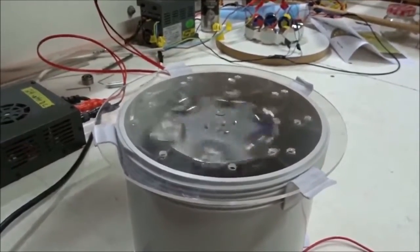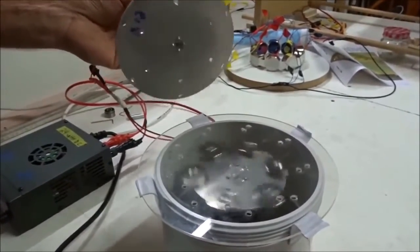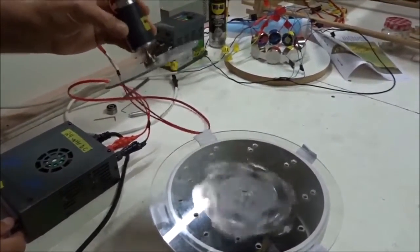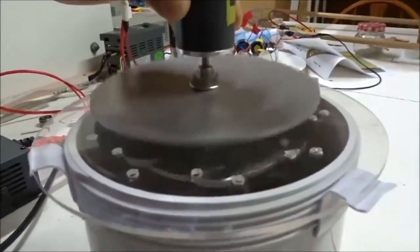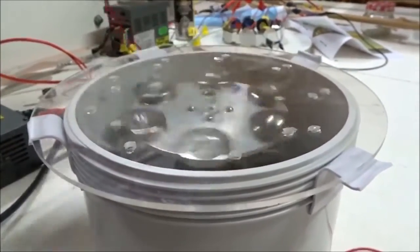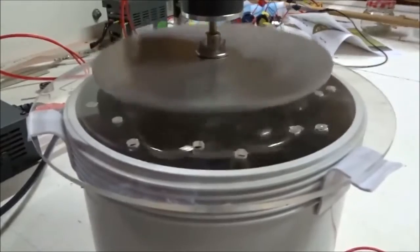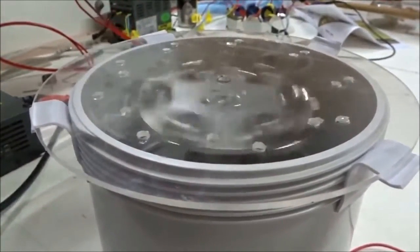So these two spinning objects can exert a force on one another through relative motion. These magnets can be spinning relatively fast, but an aluminium disc over it, just by spinning, can brake it. Let's watch this. See, it brakes it. Doesn't quite reverse direction. Pull it away, it'll start spinning again. Go over it, brakes it. Pull it away, it starts spinning again.